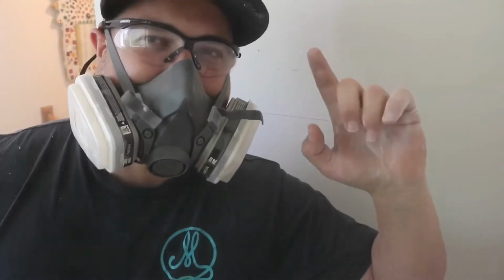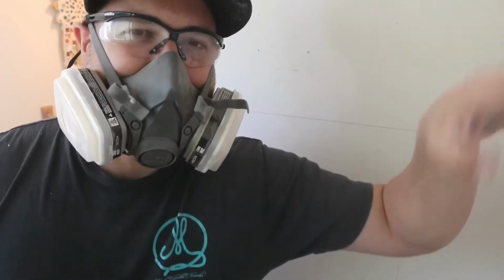I should probably mention the water main is shut off, and I depressurize the system by opening the valves at the bottom of the house and a valve in the top of the house. That lets air escape and the water to go out, so we're good on that.